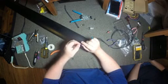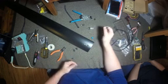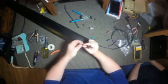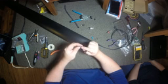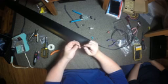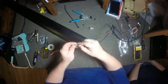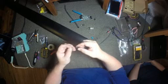Alright, now we're going to solder the terminals on the XLR. It's only important which terminals you solder to based on which terminals you solder to on the inside of the speaker. Make sure you've got 1, 2, and 3 that you hook it up the same way. I would recommend 1 and 3 being the terminals you use, but you can use any of them, as we said before. But if you use 1 and 3, they're going to be right across from each other just like this, and not use the bottom pin. In this case, it really doesn't matter what you do.